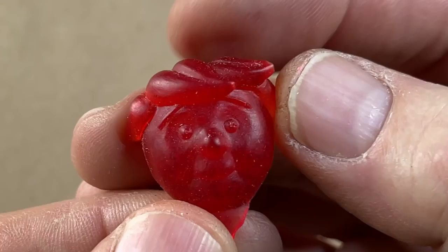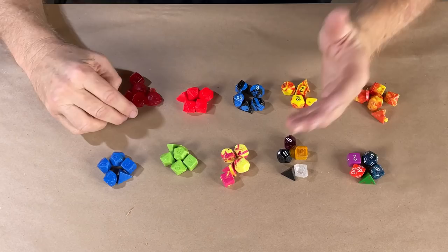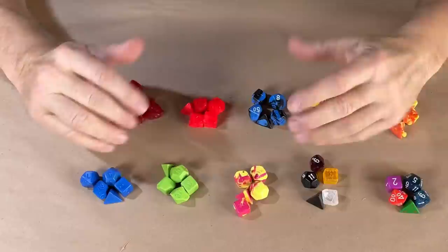Materials are really sensitive. Casting is just filling up containers — it's like pouring water into a glass, there's really not much to it. Where the complexities and difficulties come in is that all the different materials have to interact and work together, and if they don't, they cause all kinds of problems. The verdict on the mold method was it worked pretty well and gave pretty clean castings. Mastering clear resin — every time I use clear resins on this channel it's a disaster, because I've been pouring urethane for 30 years and I'm not as familiar with clear resin. You've got to learn your materials — use the same materials, get them working, figure them out, and then you can have successful castings reliably most of the time.